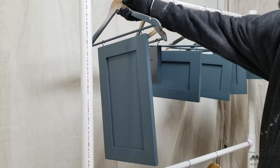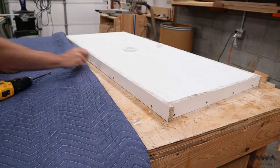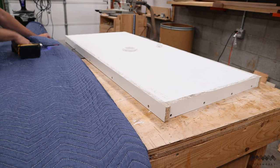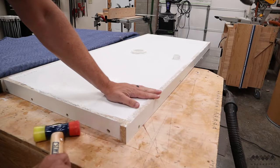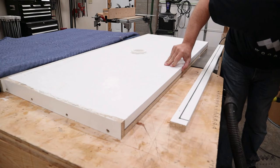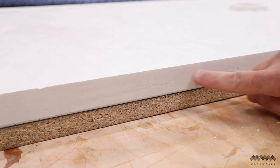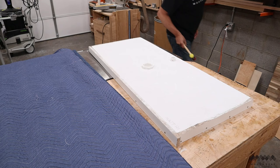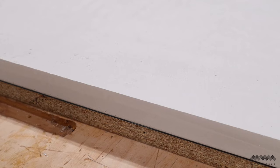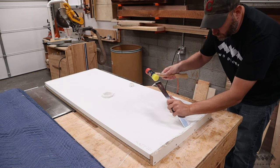While I wait for those to fully cure, it's back to the concrete top. It's been 48 hours and it's time to demold. I technically could have done this after 24 hours, but you need to demold no later than this because you've got to let air circulate around all sides to allow the concrete to finish curing. The sides of the mold just pop off easily and reveal the edge. They looked pretty good, but I spotted a few air bubbles — likely because I poured in two batches and needed someone vibrating the first batch while the other person mixed the second bag.